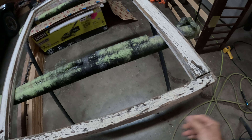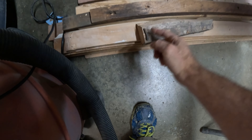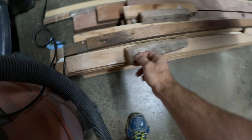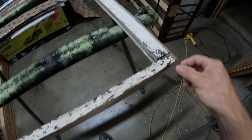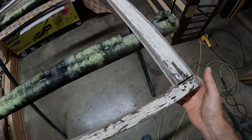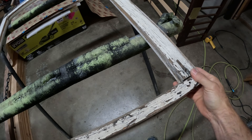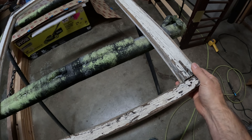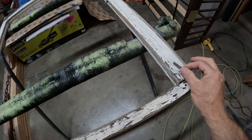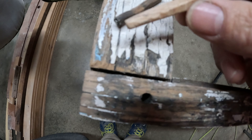The glaze is going to want to loosen up on that area as well. So what you want to do is just buy one of these dowels or make one — you can take an old piece of wood about the same length and cut off a piece and shove it in there. That's probably what I'm going to do. Usually I put a couple of brad nails in there if it's not that bad, but this one was really loose so I'm actually going to replace the dowels.